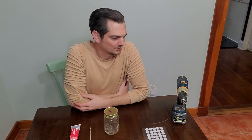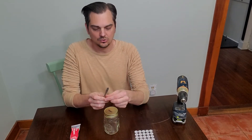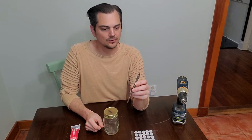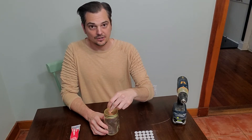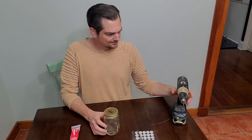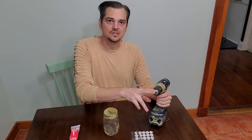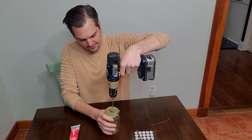It's self-healing, so it's perfect. As far as the holes go, for the middle hole we're going to use a 3/8 spade bit. Spade bits are really good because they don't leave a bunch of shards all over the place — they just push right through nice and clean. For the other hole, which has to be a bit smaller, I'm using a 5/16.